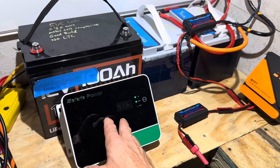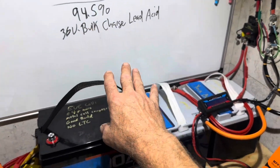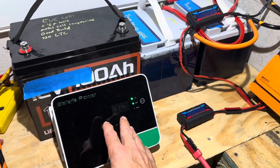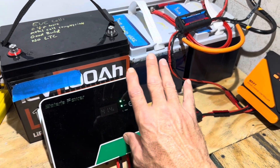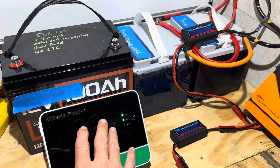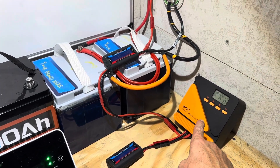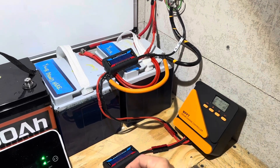This one's a little more expensive, but it can take higher voltages — it can do 12, 24, 36, 48 volts. I've been using this on the 36-volt lead-acid bank quite a bit. In low-light conditions, it's working great. I griped about the app, but I have to say the lead-acid charge profile on this is pretty good — it's bulk, absorb, float. Everything works great for lead-acid. For the price, that one just keeps impressing me. Even in low-light conditions, it can just drag power out of the sky.